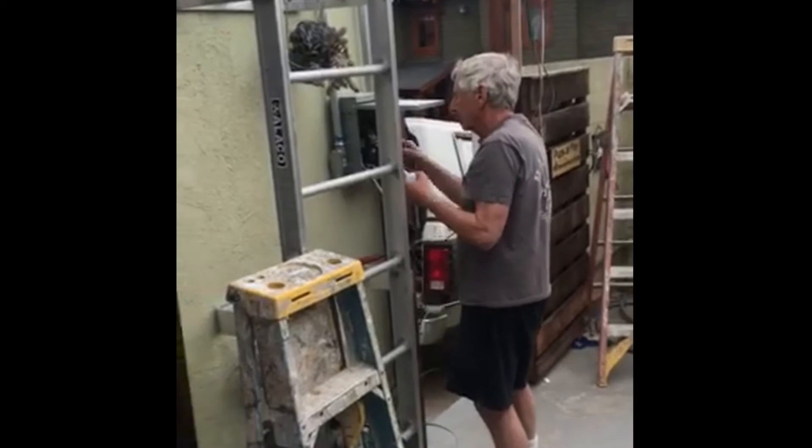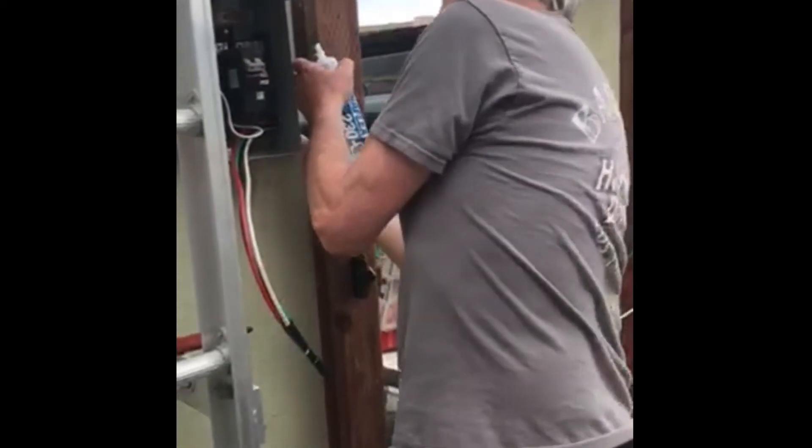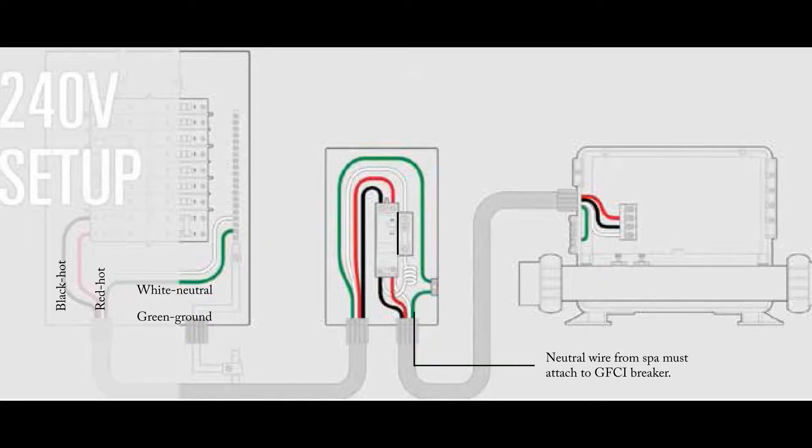Here you can see the wires pulled all the way from the main panel to the GFCI, and from the GFCI over the gate to the LB. Now I'm applying sealant to the threads of the chase nipple to make sure everything is nice and watertight. Let's talk about the ground fault circuit interrupter disconnect. For a 240 volt system, it compares the one hot side current to the other hot side current. If they're equal, everything is good. If there's a difference, it assumes that extra current must be going to ground and trips.